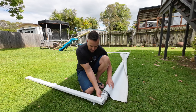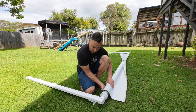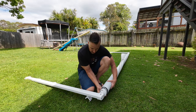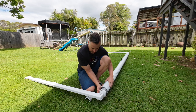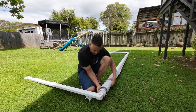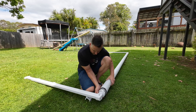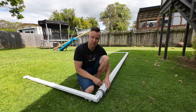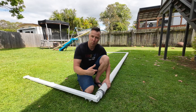Click off the tension, making sure you're holding the roller fairly firm, and count how many times it turns. We count by the screw — once, twice, three, four, five — we're at about five to six turns. So when we go to put the new skin back on, we'll wind it up six times.